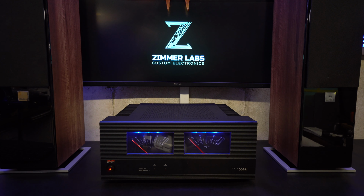But you'll notice, here's the important part, power consumption on this guy is 1440 watts. And that's the kind of thing you want to really look at. And also, the main AC power fuse is 12 amps. So really, at the end of the day, this is a 12-amp, 1440-watt amplifier. I mean, you're not actually going to see that kind of power out of it, but that gives you an idea of really how much power this guy has at its fingertips. If you had an Integra Onkyo M504 here, it would be 400 watts maximum on the back, not 1440. So that's a huge difference.